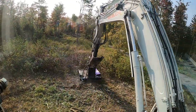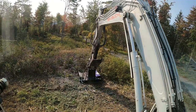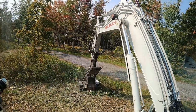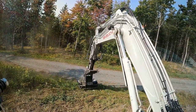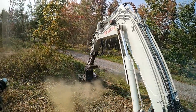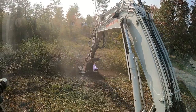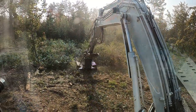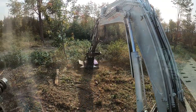As I mentioned in a previous video, if you notice right here - you probably can't see it - the boom is offset to the left a little bit. The reason is that way I can see the right edge of the mower when it's in close; otherwise the boom blocks the view of that side and I can't see where I'm swinging it. Once it gets out a ways that's not an issue, but when it's in close it is. So I leave it at an angle - probably about 20 degrees.